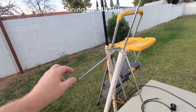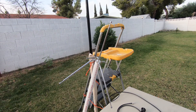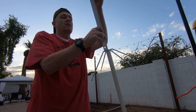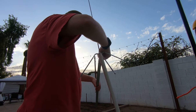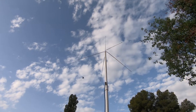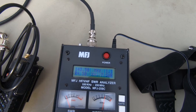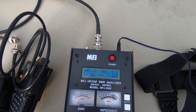So what we're going to do first is tune for two meters. I know that roughly for this antenna the telescoping antennas are going to be about 20 inches each. So I'm going to extend each of them 20 inches. You can see they've been extended out. One to 1.2 and 50 ohms — so 20 inches is it for two meters.